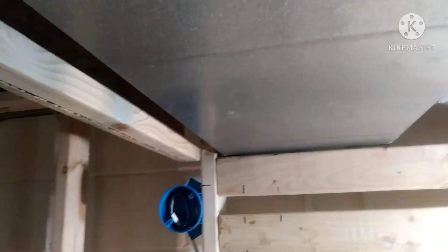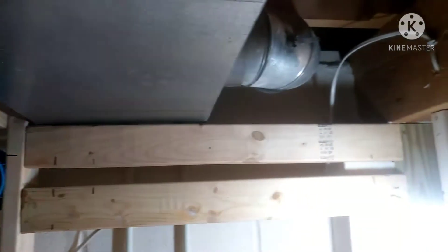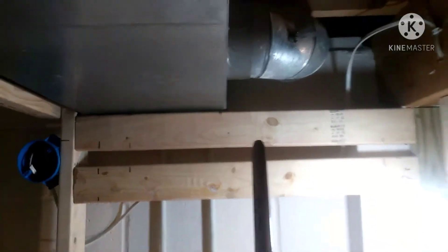Aside from the corners, you got to square those up. I made it about a quarter of an inch below the ductwork to leave a little bit of room. I'm going to split this in half — it's about 30 some inches there — so I'm going to put another one in the middle to catch the drywall, otherwise it's going to sag. Just make another panel and stick it across the middle. Make sure if you have dampers or anything like that, they're set in the right place, because if you're covering this stuff up you're not going to be able to get to it.